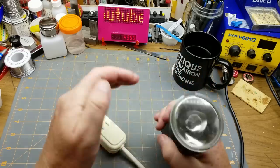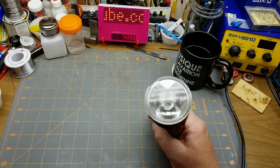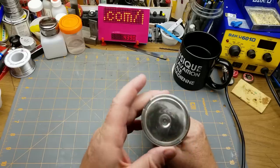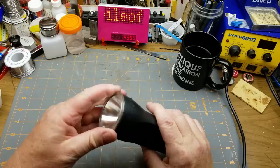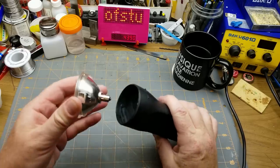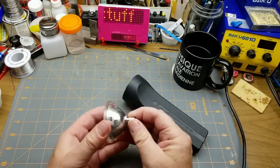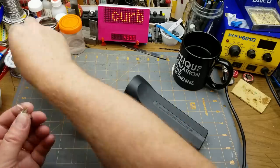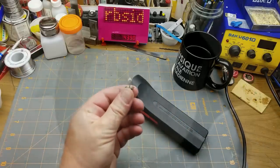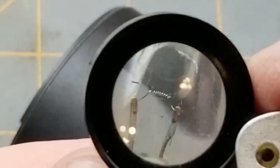Let's take a closer look at the one I've got. To charge it, you just flip that plug out and plug it into the wall and let it sit trickle charging. I've had this thing plugged in for a few hours already and when I turn it on, nothing happens — so either we have battery problems, which is most likely, or it's the bulb. You can apparently just pop the bulb out like that.